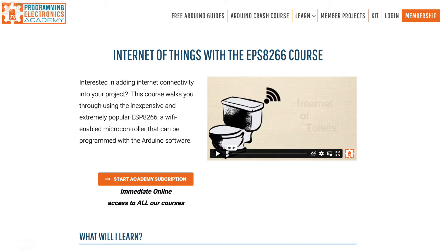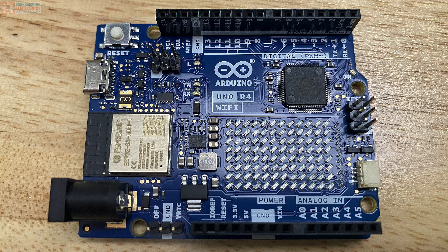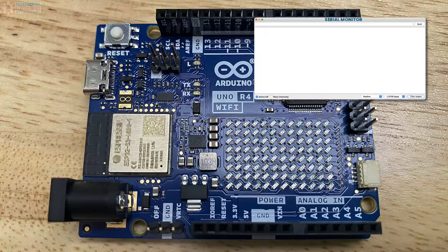There is a new feature on the Arduino R4 Wi-Fi that will help newcomers to programming. If you've programmed for even one day, you probably know about cryptic error messages. But worse than a cryptic error message is getting no error message at all — which is what can happen if your Arduino performs a fatal operation like dividing by zero and goes into an unresponsive state. The R4 Wi-Fi sports an error-catching mechanism that detects operations causing a runtime crash, like dividing by zero or an out-of-memory error, and sends an error to the Arduino IDE serial monitor with a hint as to what line of code might have been the culprit.